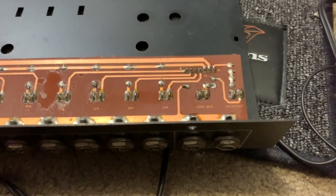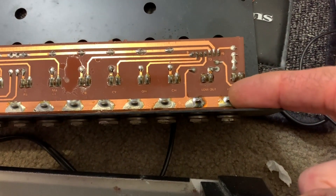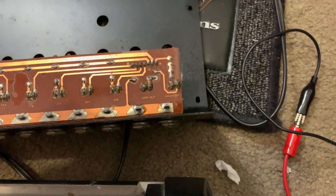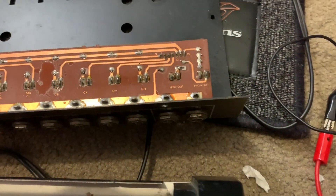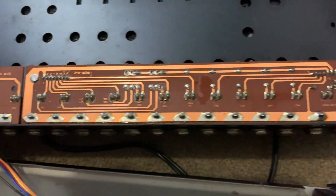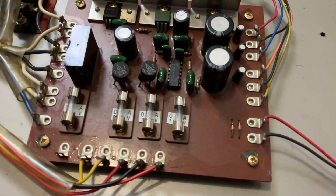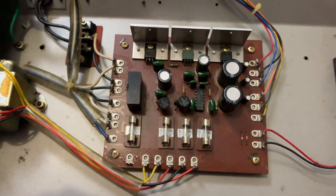This is the output jackboard. I've gone through and re-flowed these solder joints — heated them up and put new solder on. Where the hot contacts and earth points are, I re-flowed those to make sure there are no dry solder joints, sucked off the old solder and put fresh solder on, just to make sure the outputs are solid. I also checked the main capacitors and they're not leaking. They're good in the power supply — all checked out okay, so no need to rip them out and replace them.